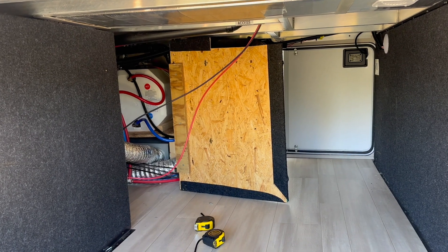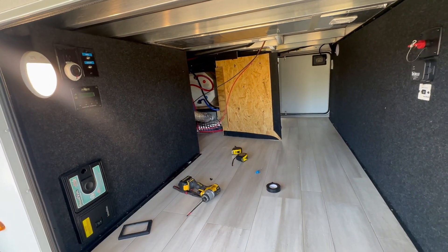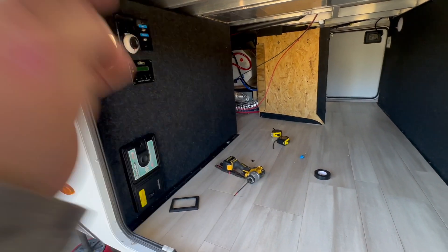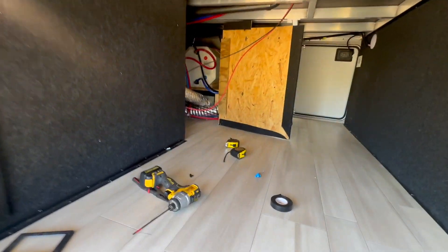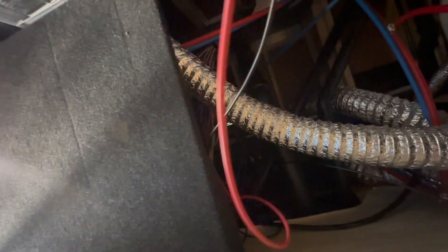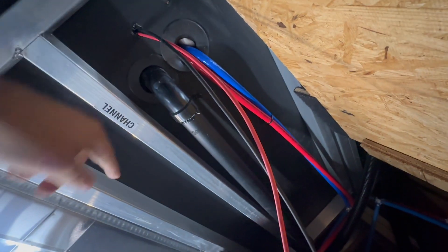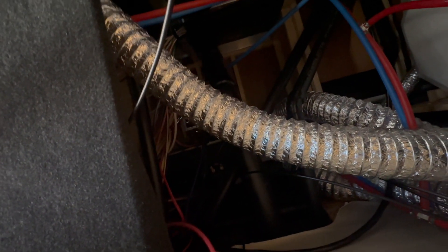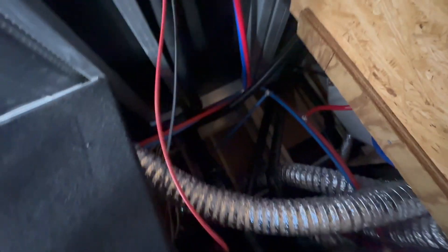Back to this project — same thing as we do a lot of times. The compartment we're working in is over there. We ran the wires underneath the belly pan and it popped up in a compartment over there. All right, I'm in. They come up here and there's an area right there — that's where all the wires come up. We ran the fresh set of solar wires here coming down from that satellite access port channel. That's where the AC mains come up over there, and we've got some running to the shore power plug and another one running to the main panel. The HDMI and USB cables also run over there, making for a nice clean run with no wires exposed. We just need to cable-clamp this up here and this is good to go.